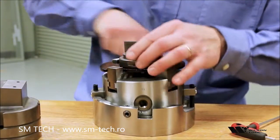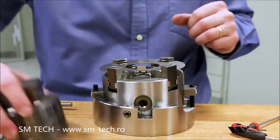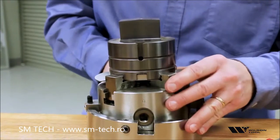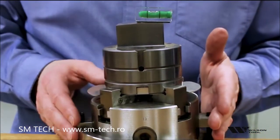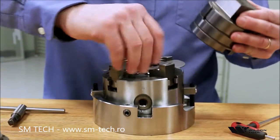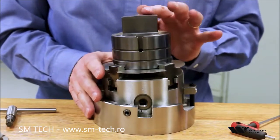For a rooftop shear, what I have is an old-style three-and-a-half inch tool. We have a different keying plate for that — it's got a tab here that lines up with the keyway on the old-style tool. Tighten the tool up again and adjust the angle. It just happens in this case that I'm already at the correct angle from that previous punch, so I'm ready to grind this flat surface. Then I want to turn it around 180 degrees to get the other side of the rooftop — I can just take the tool out of the chuck, turn the key plate around 180 degrees, turn the punch around 180 degrees, and now I'm already at the correct angle for the other side of the rooftop.